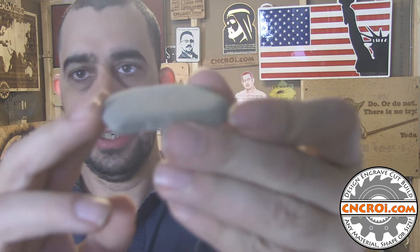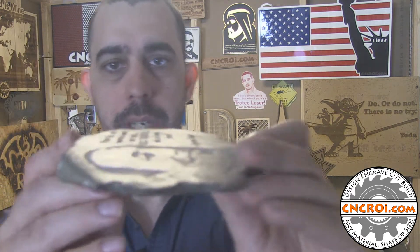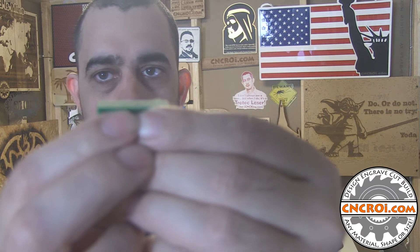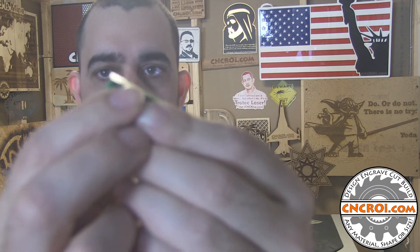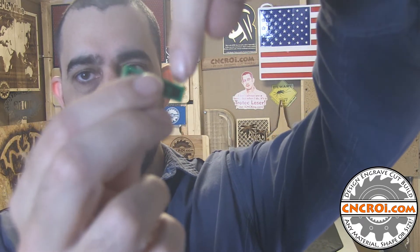As long as the stone is relatively flat, we'll get a relatively smooth and even result. The problem with stone sometimes is that it has a bit of a curve to it. Think of a piece of Lego — it's totally flat, which is ideal. If the stone is a little off like this, the laser focus going straight down will be in focus on one area and out of focus on another. That means I need to run the laser two, three, four, five, or even ten times at different focal heights to get a consistent engraving.